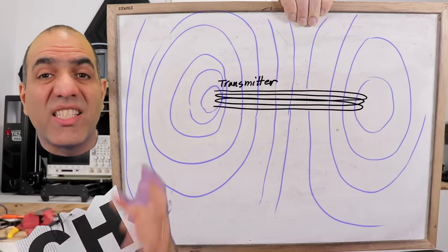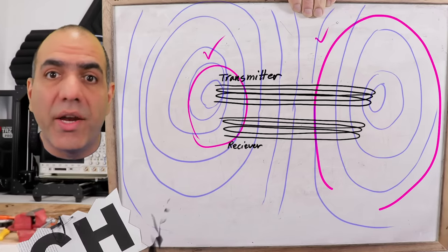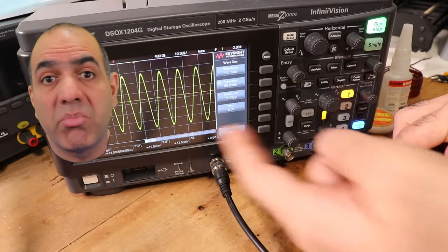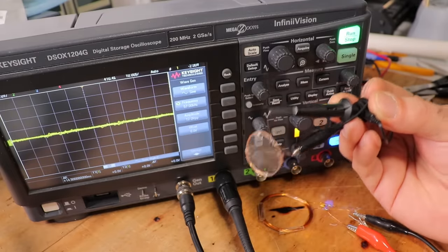As long as the coil size is smaller than the coil inducing the energy — the fields have to close around the wires, not inside or outside. I tried a bigger coil and even bigger, which helped, but then the weight was a problem too. Change of plans! I can't keep increasing the number of turns — it will get very heavy and won't be able to fly. So instead, I decided to go to a wider coil with only a few turns — six and a half turns — and whatever the resonance frequency of this circuit will be, I'll tune my transmitter to match this. I mounted the coil on a thin plastic sheet so it doesn't deform.